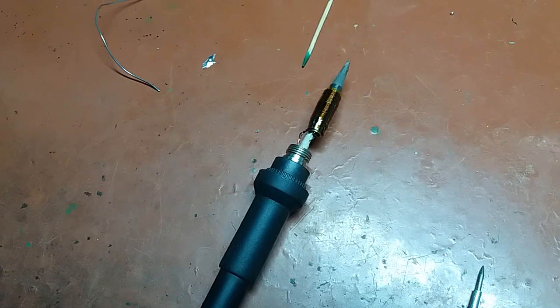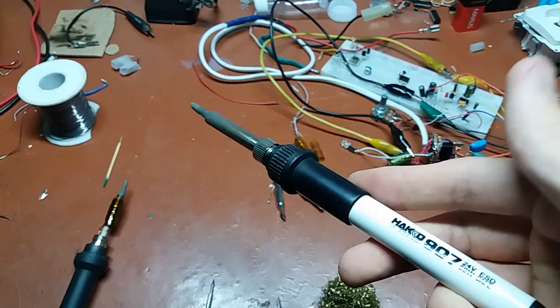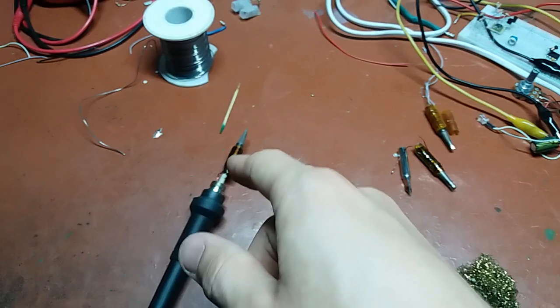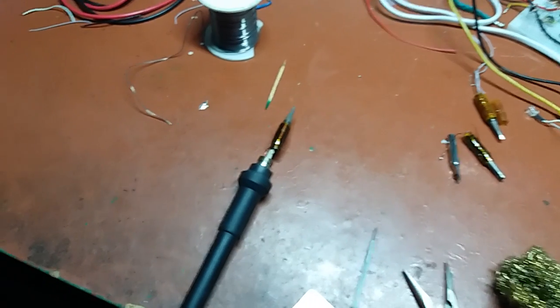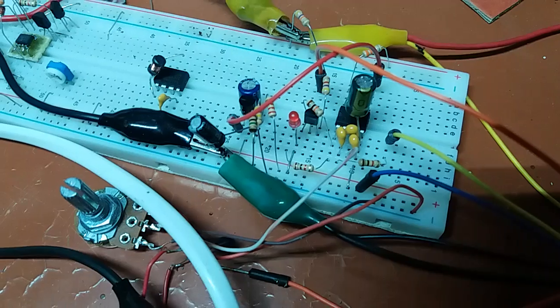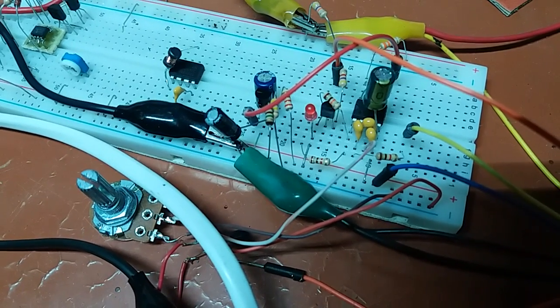Unlike some contraptions by that Russian blogger, this one has feedback. It uses a heater from this kind of iron — not a thermistor as a temperature sensing element, but a thermocouple. The heater originally came from a handpiece from this station, which had a thermocouple, and that's exactly what is used here to sense the temperature. The thermocouple is fed into a little comparator using an LM2904.